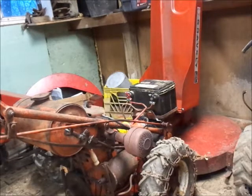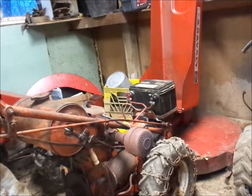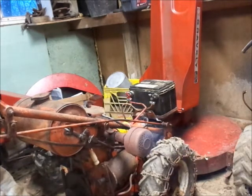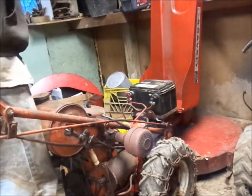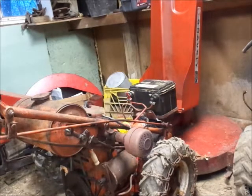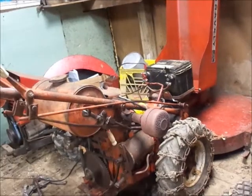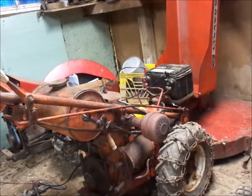I don't know, it kind of acted weird there. I thought it fired out the intake, so maybe I got the timing off. See what it does now. Nope, I'm pretty sure I got the timing out. Well, so much for the mark working out. So now, I gotta time the motor. Alright. Okay, everybody point and laugh at the new guy. It was 180 out.